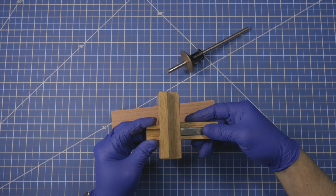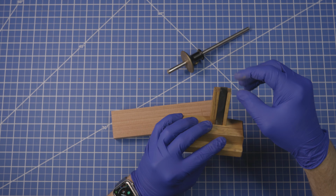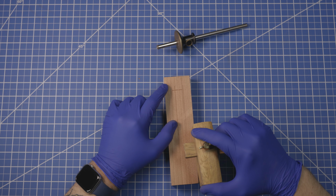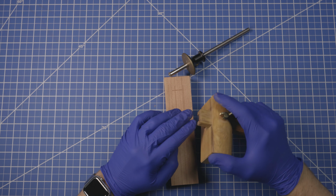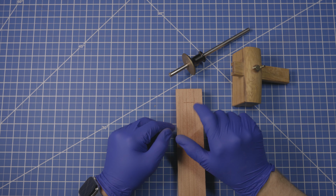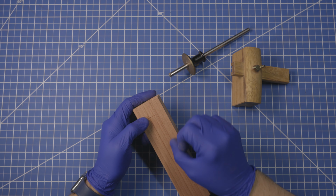There are styles similar to this that use pins, basically nails, through the beam, and the wooden beam slides as opposed to having the blades on a separate kind of slot. There are designs where instead of these nested style blades, it's a side-by-side dual beam that slides individually, because they're parallel lines, so it doesn't terribly matter that they're not parallel in two dimensions. However, it does make it a little bit harder to start and stop the two in the same spot because they're misaligned, so the one will go before the other. Minor point, and that's one of the reasons why I like this style. Also, the slicing of the blade as opposed to the scratching of a pin is a little bit more precise. Tends to not wander on the grain as much.